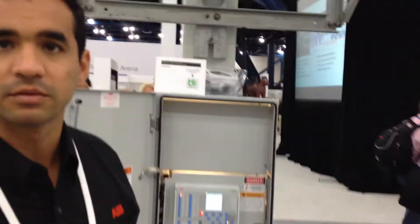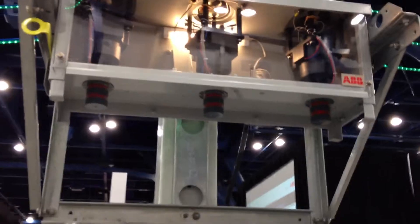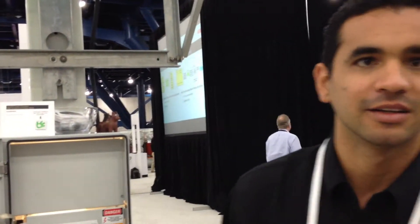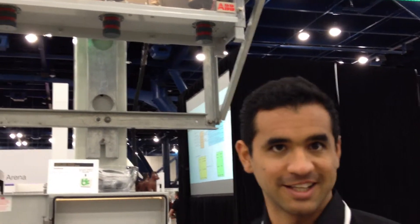What kind of voltage would you see here? This is a 27kV unit — 27,000 volts. It's rated for up to 12,500 amps of short-circuit interrupting current at that voltage.